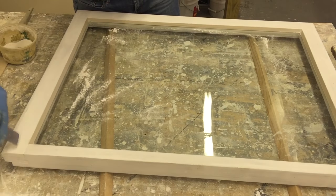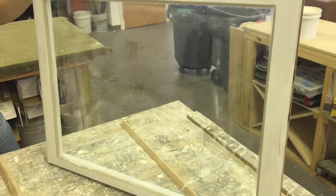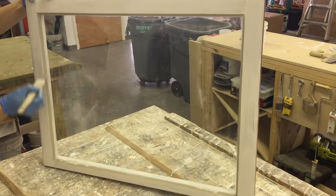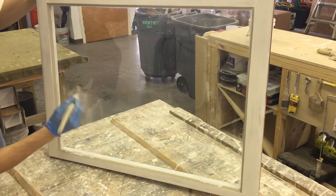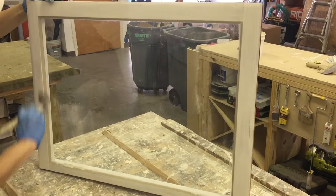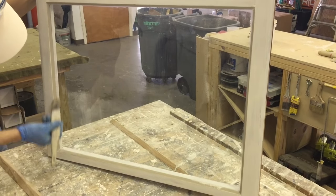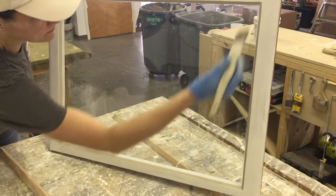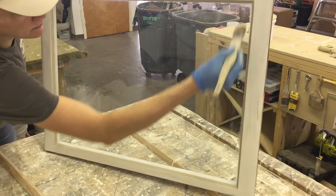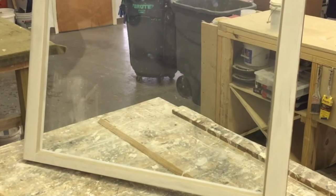Karen always comes back with a knife to clean up any problem corners. Tilt up the sash because there's still some extra whiting left on there, then just brush the excess whiting off the glass. Do this relatively quickly right after you're done glazing — don't wait 30 minutes, an hour, or the next day. While the oil is fresh on the glass, the whiting will help you clean everything off without needing Windex or any other chemicals. You can also reuse the whiting, and once you're done you've got a beautifully clean window.